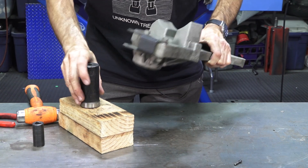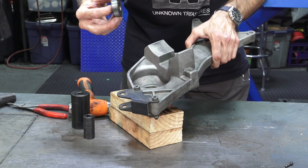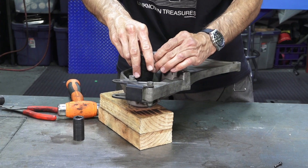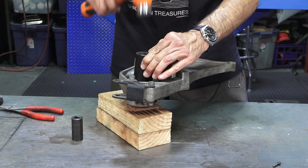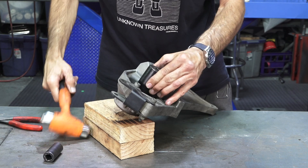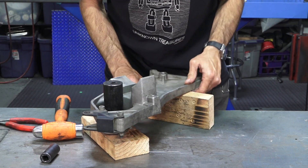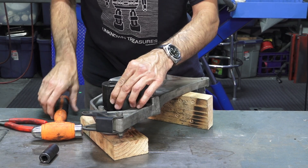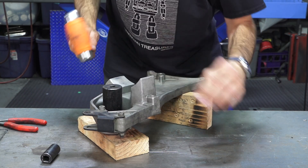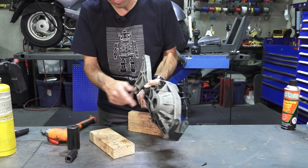Once you have it up to about the boiling point of water, be very careful with your hands — you don't want to burn yourself. Supporting the part, drop the bearing into the cavity. It may almost just drop in. If you're struggling with it or the bearing starts to go in crooked, stop and heat the aluminum more. Make sure the socket stays square — wear gloves when dealing with hot metal. Support the part with wooden blocks to make it easier. Listen — you'll hear a different sound when the bearing is fully seated. That different 'ding' means the bearing has bottomed out against the flange, and that's as far as you need to go.